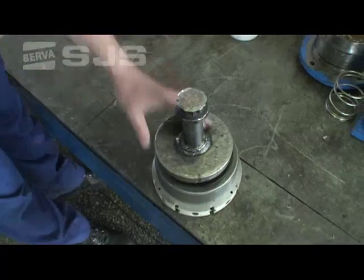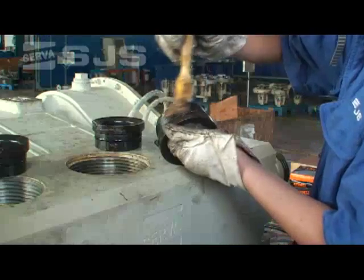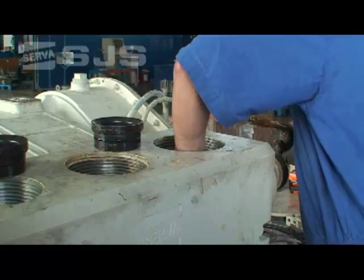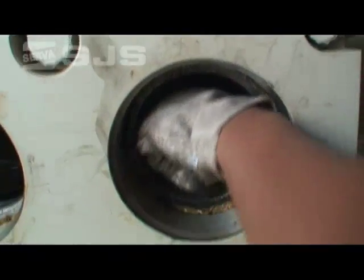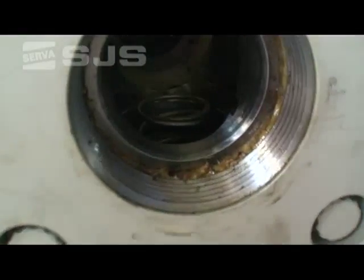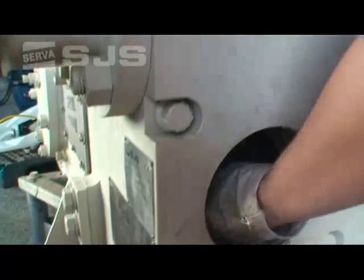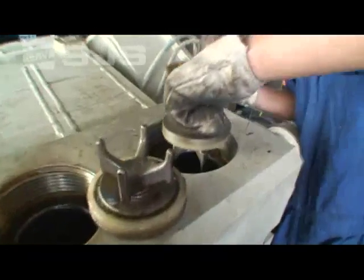Carefully tap the oil rings into the packing nut. Do not damage the oil rings. Install the six valve seats into the pump head and seat the valve seats with a copper hammer. Install the suction valve into the pump head, then install the suction spring. Hand install the suction valve stop in the groove in the pump head. Using a tool, place the suction valve stop perpendicular to the plunger.